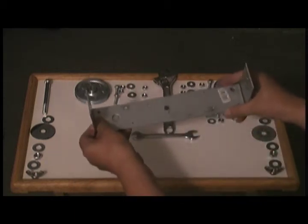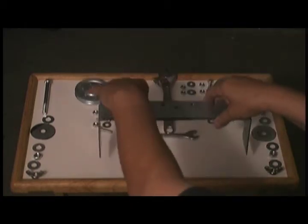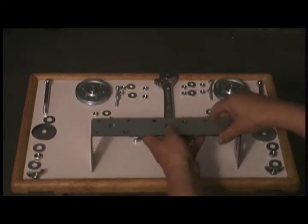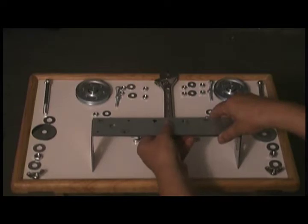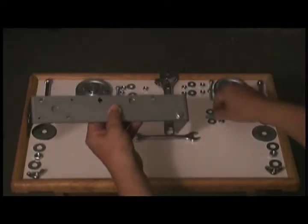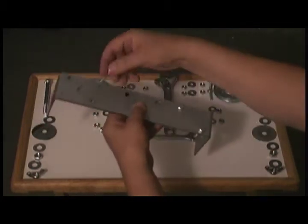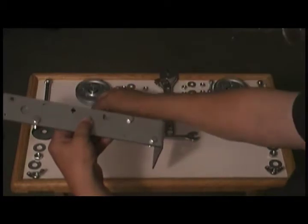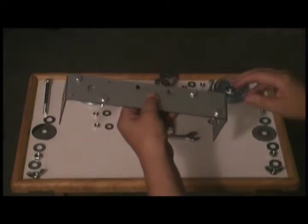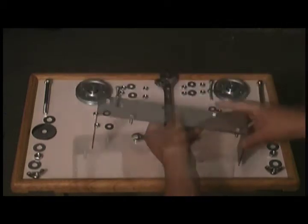Drill the required holes in your 2 angles, part J. When purchased, the angle has a series of holes that are already pre-drilled. If you use the existing holes as a go-by to start with, they're going to be identical. That's what I did. And by starting this video, you can see exactly where the holes are drilled. Now, install the 4 1/4-inch bolts through both angles and attach washers and nuts, then tighten. These are listed on your parts list as Q, R, and T, like Tom.